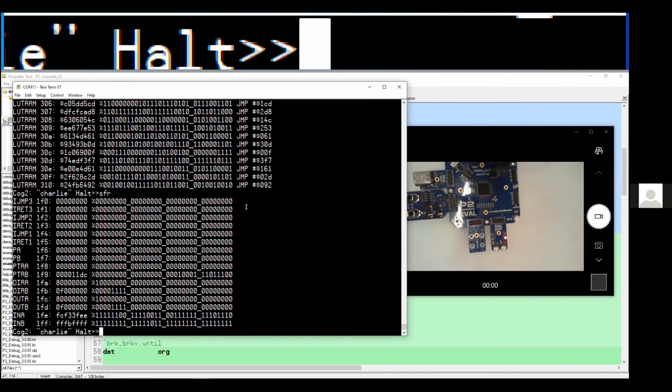Yeah, the interrupt service routine in the background just has a basic command set of read cogram, write cogram, read LUT, write LUT, and a few other things, where it's collecting the relevant data of the program counter, the flag states, and the actual stack contents. They're quite small little routines, but there's a bunch of them, and they all talk to the debugger. Whenever the debugger launches any of these, it puts them all in the debug state. So you can have them all start in run mode and everything will run at normal speed, and you can just select which cog you want, break into it and interrogate it.